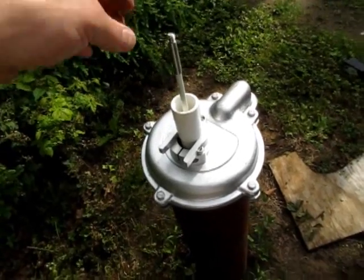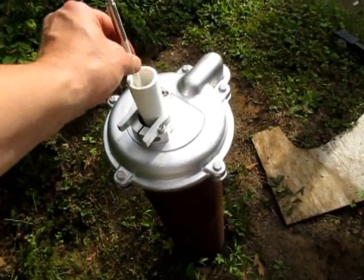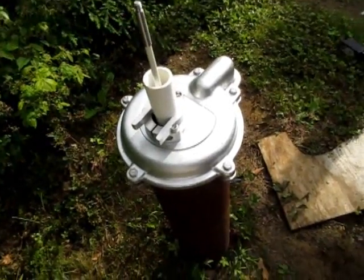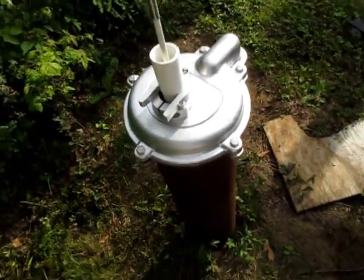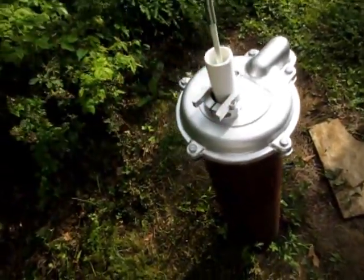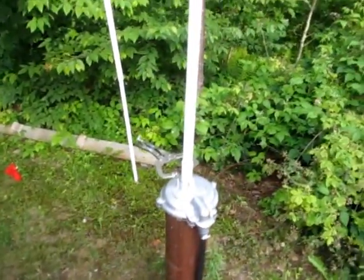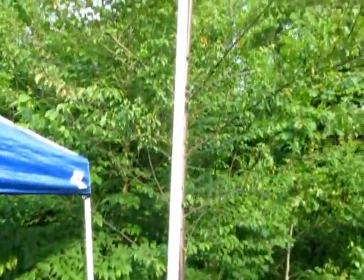Now that's just the process of attaching a new sucker rod, a bushing to keep this from rattling around in the pipe, and then putting a drop pipe over it. Take the tool out, put the tool back, drop it down another section to the flange, do that 5 times, and we're done. All right, I've got now 5 sections down the hole, and there's the last section.